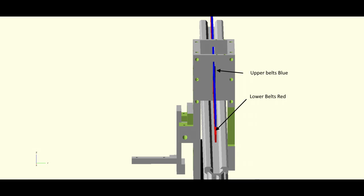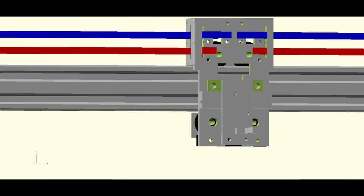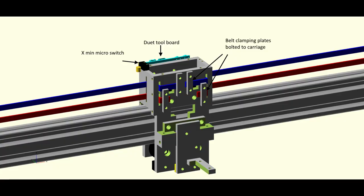The belts bend at another 90 degrees where they'll be clamped in place. This shows the belts in position relative to the X rail, going through the side plates, bending at 90 degrees through the slot, bending again, and then being clamped. It works very well and is extremely strong because you've got two 90-degree bends and then a clamp. You can hold the belt against the front carriage plate with a finger and thumb and pull as hard as you like and it'll never move. The belt clamping plates are about 6mm wide and 20mm long with 3mm holes for bolts; the carriage is threaded and the clamps have clearance holes.